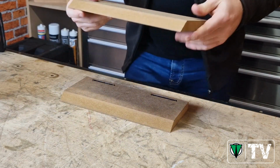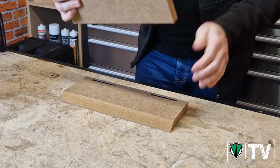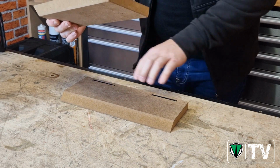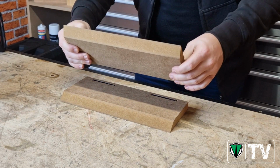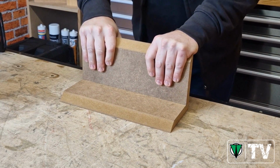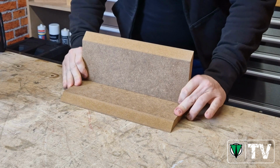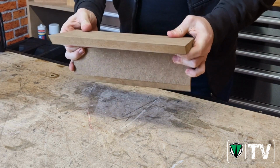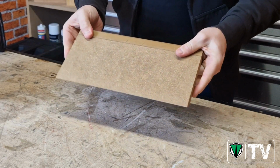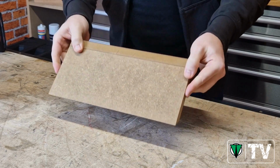and there we are. Now remember the Tenso is sold as a glue clamping aid, so we would still PVA this. Fill the connector with glue as well, that actually makes the bond 30% stronger. Line up your connectors and clip it in. We do get a little bit of lateral movement if required, if you're not perfectly lined up, but we're pretty spot on there, and you'd be good to go. Leave your PVA to set and off you go.